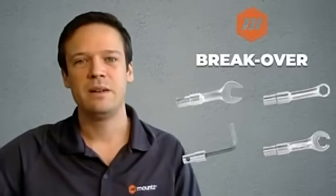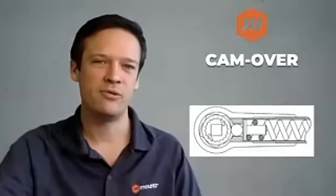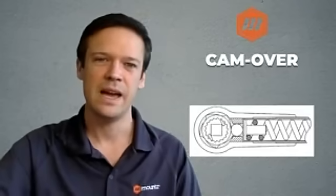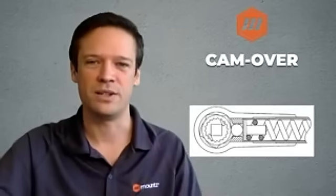Now that we've seen click and breakover wrenches, let's have a look at cam-over wrenches. Cam-over wrenches work very differently than the two previous types. There is still a spring pushing on the ball, but this ball is actually linked to a cam, and when the torque is being reached, the cam will slip, reset, and get ready for the next application. Hence the word cam-over or slipper wrenches. So what that means is that just like for the cam-over screwdrivers we've seen previously, cam-over wrenches will completely eliminate any over-torquing occurrence, making it a much safer tool for your applications.